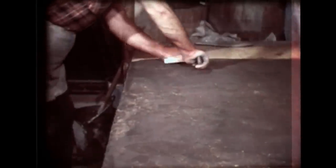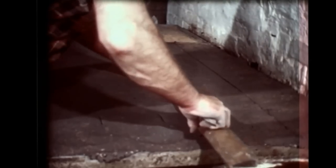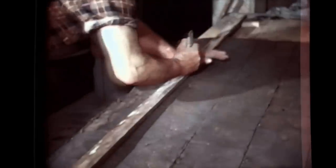After you've rolled your frame in, you get your measuring stick and you've got various sizes and you mark them off with your knife, and you've got to see that they are level. After you've marked them off, you use your rule for cutting out. The rule has to be on the lines you've marked, and you've got to press the rule to make sure the suction of the marl holds it — because if you get one end higher or lower, then you've got what they call a mash cut. So you hold it dead level and cut through each marking, and that is the sides of your sagger.